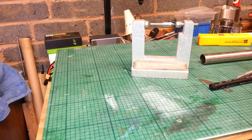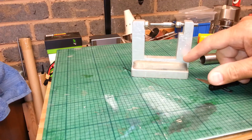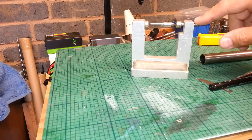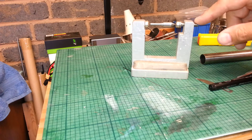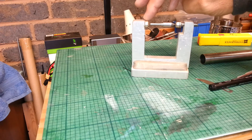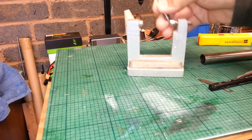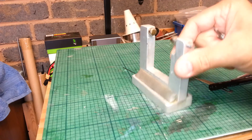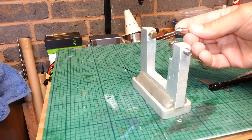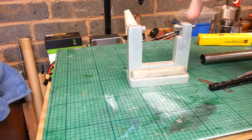This is my balance jig. Basically all you need is some aluminium — don't put any steel in it anywhere. Stainless is okay. A stainless screw at this end or a brass screw would do just as well. I've got the magnet just glued to it with epoxy — magnet this side glued with epoxy too. On these magnets there's a thin bit of brass shim that's just to protect the end from getting damaged on the hard magnet. That's just stuck on with epoxy.